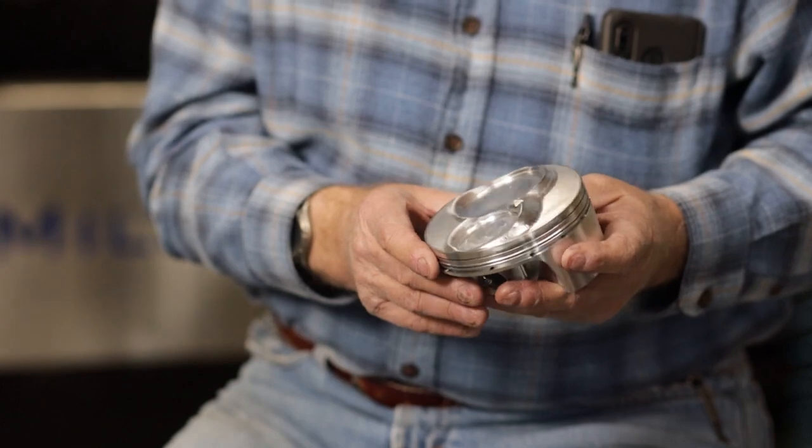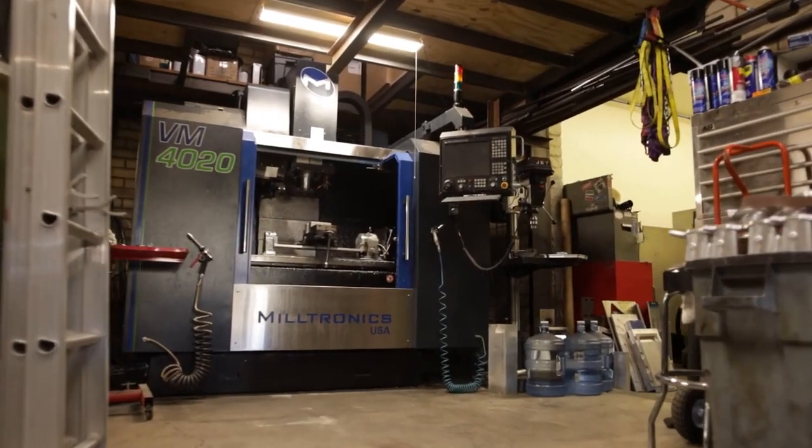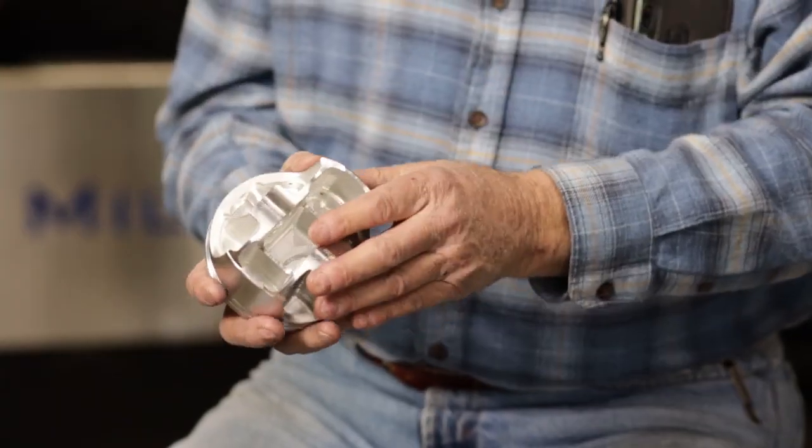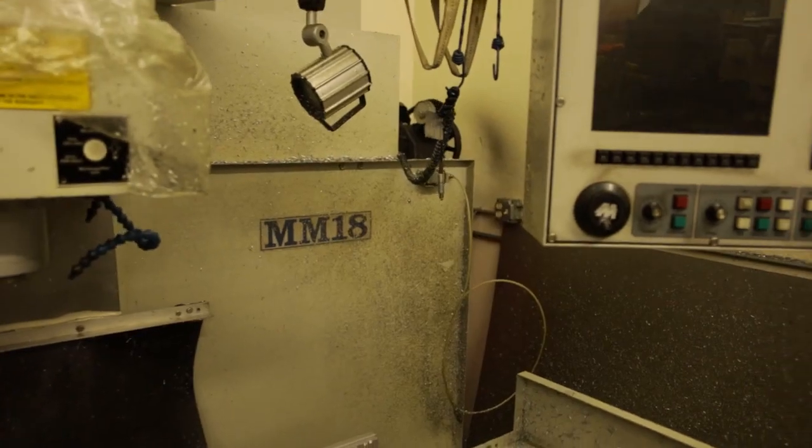The finish is kind of an artistic thing and people really like the way our stuff looks. That's part of the programming and part of the accuracy of the machine — the combination of the two to produce that. I'm not building mil-spec stuff, so I don't have to go to tenths of thousandths in accuracy on an intake manifold, but it certainly has to be within a thou or two. It's plenty accurate enough for the kind of things I'm doing.